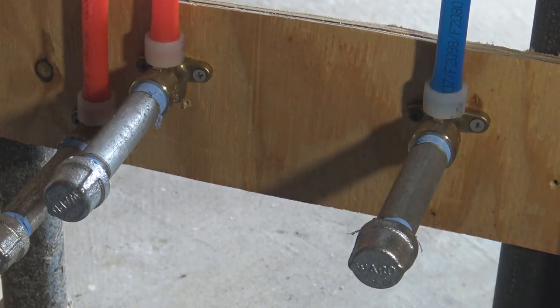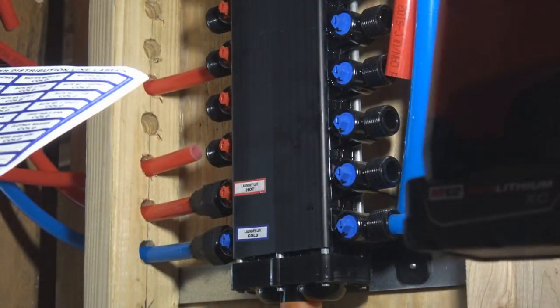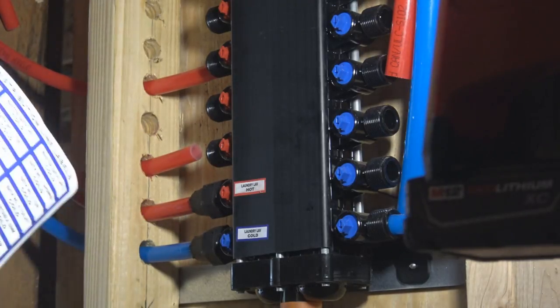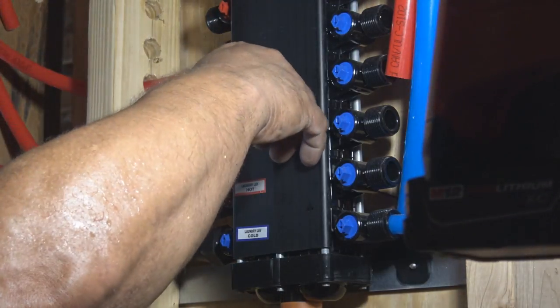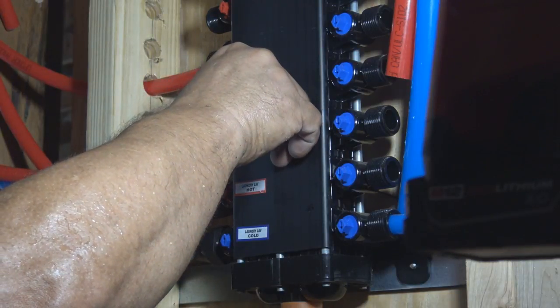And again, back to the caps that I have on the end of these. I have the caps on there and not the valves, because once they drywall, tape, and float, paint, all that stuff will get on the valves. And not only that, it makes it a little harder for the drywaller to cut his holes and make it nice and neat. So therefore, we cap it. And we'll come back later, uncap it, and put the cutoff valves on there.